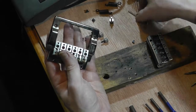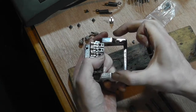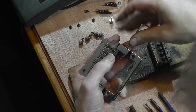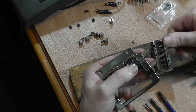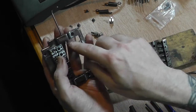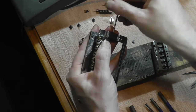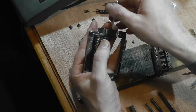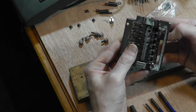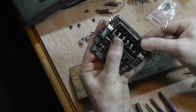Oh, yeah. So now this is a part, you can see how the cam bearings are held. So two Allen screws squeeze from either side, bearing upon the edges. Actually, they go right through, I think. Let's see what the front of the screws looks like. Yeah, so I think they sit in the bearing. So what I've got here is just the head of one of the screws poking out. So I'll sit this bearing on that screw. That'll just locate us to start with. And I'll wind that screw in a little bit.